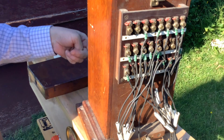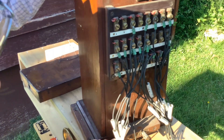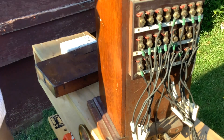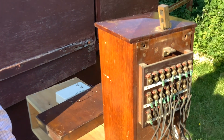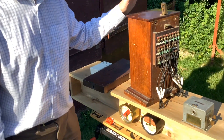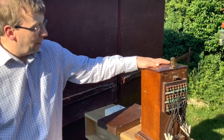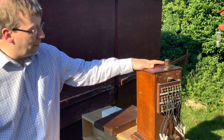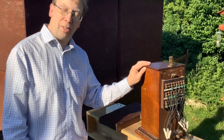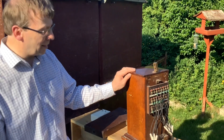I can work out where it's from. It received and dispatched trains on the up line, which is unusual. It received trains from a place called WN and dispatched them to a place called Hat 2, and so we can state with complete certainty this is from Welwyn Garden City — which is rather nice for a block instrument with Welwyn control. This is a later one; it wasn't involved in the accident. Photographic evidence shows these instruments aren't common but there seems to have been a concentration of them at the bottom end of the East Coast Main Line.